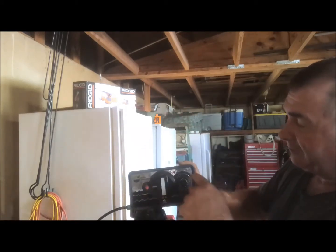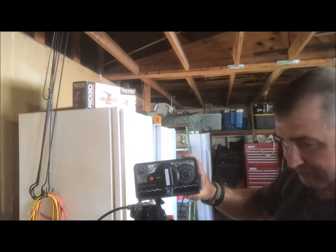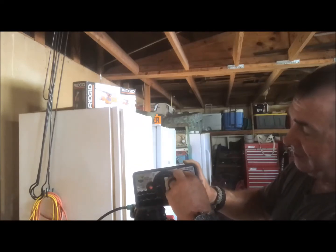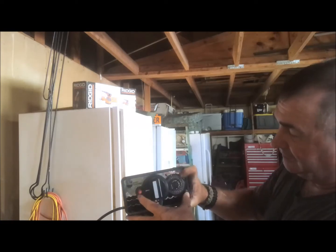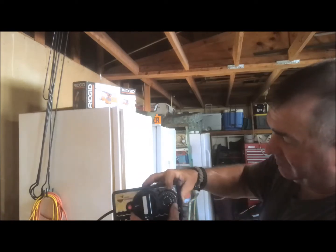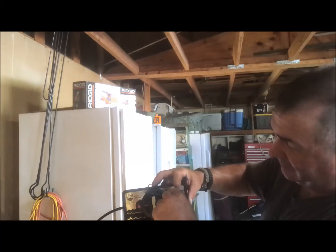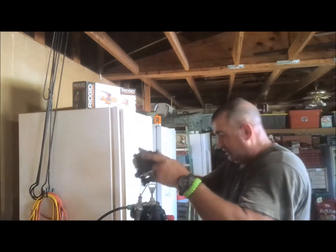Okay, and this over here is how many gallons until regeneration. This is a 1 cubic foot water softener. I don't know how hard their water is, but they have it set for every 800 gallons. And you just pull this white one out like this, and you turn it, or you hold the black one in the back, and then you just turn this to however many gallons you want. So I'm just going to set it on 1,000 because there's only 2 people that live here.